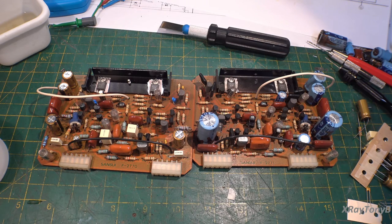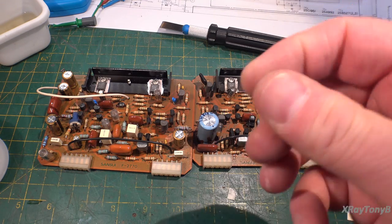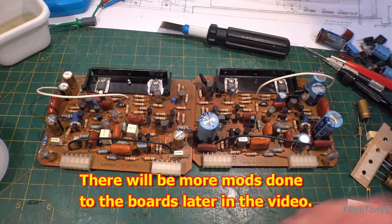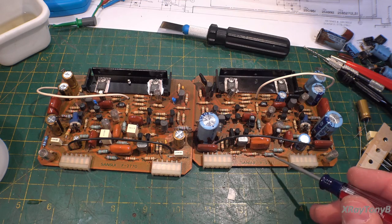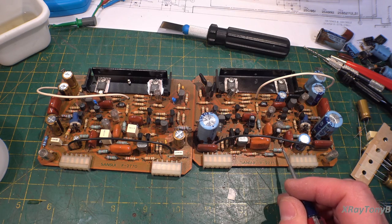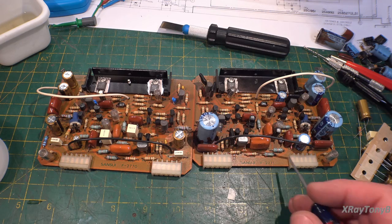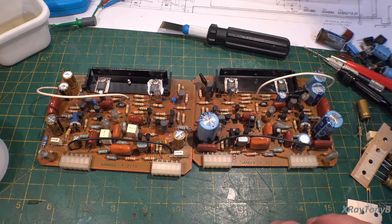One down and one to go. There were a few components that got trashed because of the glue — like this one where the lead just came right off, corroded all the way through. A couple of resistors were bad too, but got them all replaced. Now one thing to keep in mind — all these blue resistors in this area are your RIAA compensation circuit. Some of these are super high precision, and you don't want to replace them with something else. By changing even slightly any of these values, you could throw off the RIAA curve for these preamp modules.